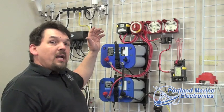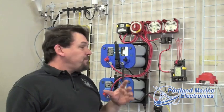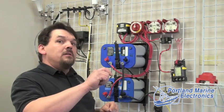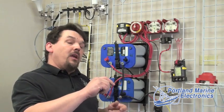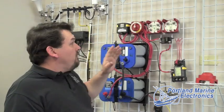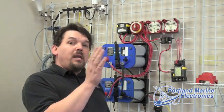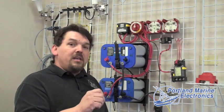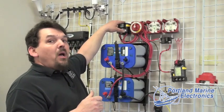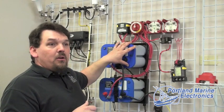We also run what we call starting isolation to your starter, which connects to the center terminal on the ACR. The starting isolation wire connects to the start position, is fused, and runs to this box. When the batteries are combined — because you've been running your main engine and you shut it off, say to clear debris from your jet pump intake, and immediately restart — we could still expose the electronics on the house battery to the voltage drop under cranking and the subsequent spike when the alternator kicks on. The starting isolation circuit disconnects the combined condition so that the house battery and electronics are isolated from that voltage drop and spike under cranking conditions.